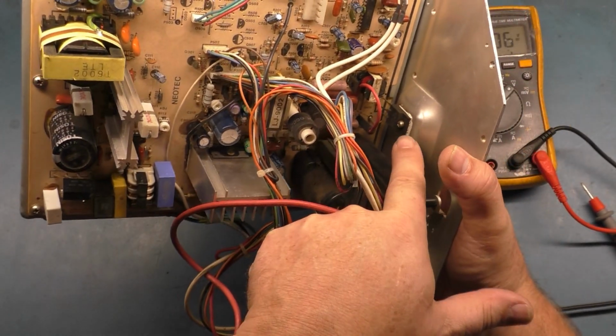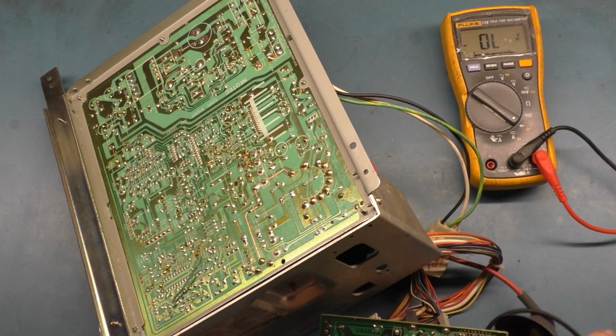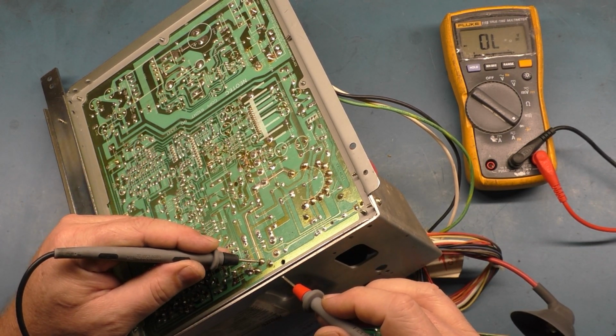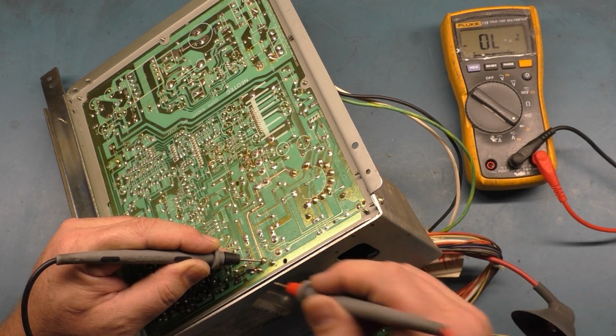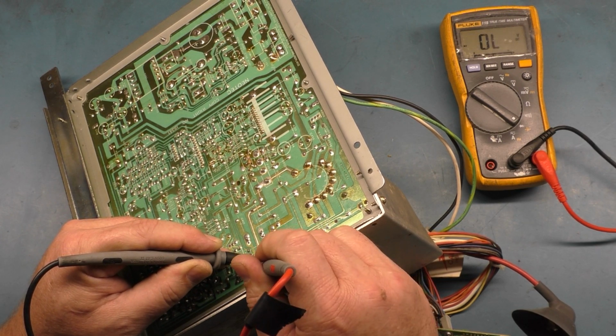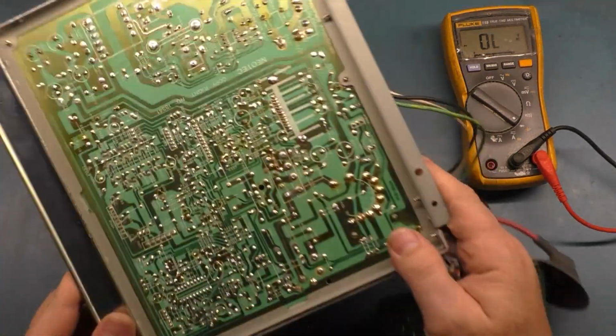is again this guy right there, so we want to test on diode mode, and our negative lead on the collector, and we should have 0.5 or 0.45 voltage drop to the emitter and the base. So here's the emitter, 469, and base, 469. HOT is good. I'll bet you it'll fire right up.